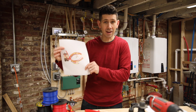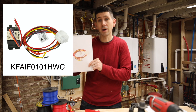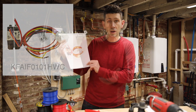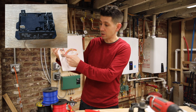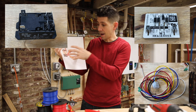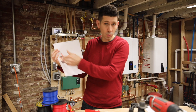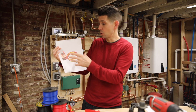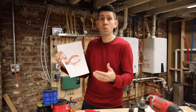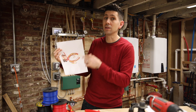The hydronic relay kit that Carrier used to sell, they stopped manufacturing back in 2016, and it's near impossible to find one unless you're a reseller or something like that. The hydronic relay kit consists of a relay device, a control board, and a wiring harness. Now when you try and order anything, you get the replacement parts as piecemeal. So we're ultimately going to be rebuilding this entire thing from the parts and pieces that we've gotten, and I want you to understand what goes into building this if you want to recreate it for your system.